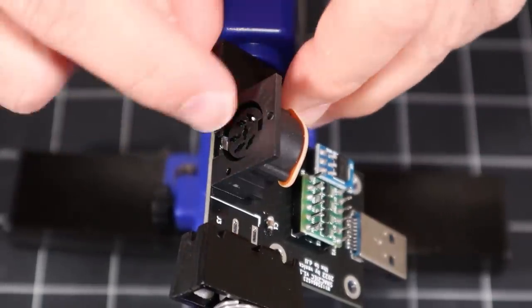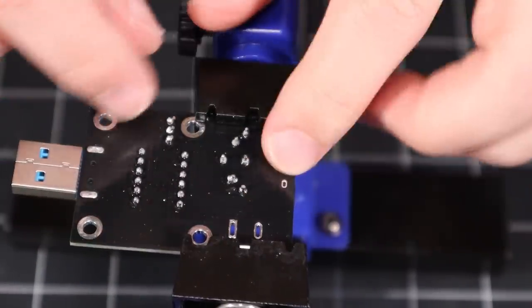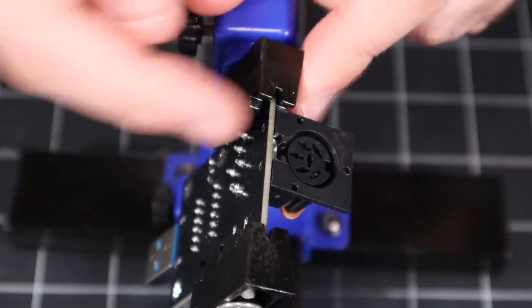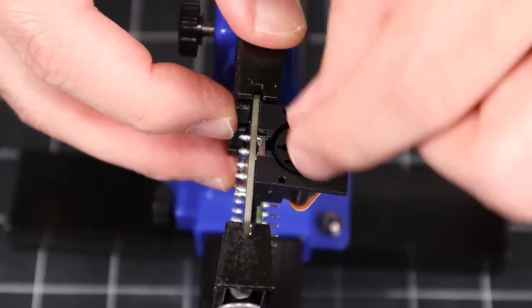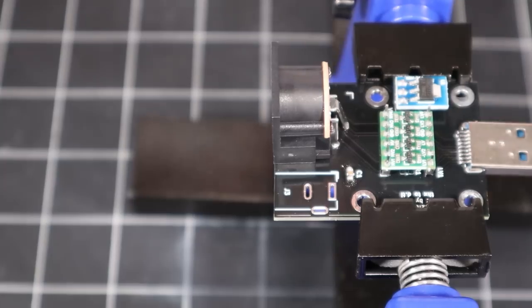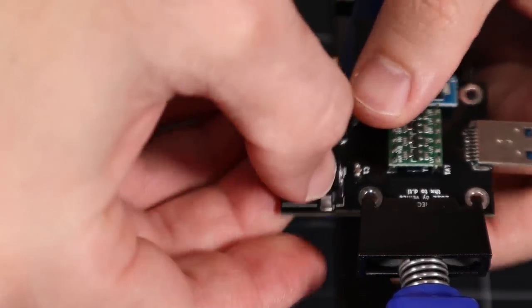So yeah, I checked and there is a ground pin on the 6-pin connector. So I think these are just for support, to give it stability when you plug and unplug things. So I'm going to replace this connector with a suitable one later on, but we'll at least have something we can test now, and I'll just have to be careful when I insert and remove cables. And last but not least, we've got the barrel connector for the auxiliary power here.